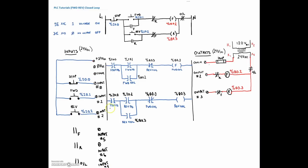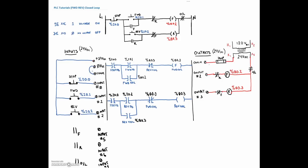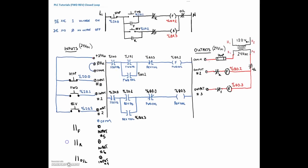Obviously I've got 3 and 4 here, but I'm not showing them in the diagram. I've also got other common connections — my common connections have to be joined together so that I have a path back. On the previous video, I had changed the color to blue for my wiring, but I forgot to jumper my common back to the 0 volts. So if I had a common here that fed each of these, I need to put a jumper from this common over to the negative. That's one of the things that will screw up your program — if you don't provide a path back to the negative of your power source, the signal will be coming into the input terminals but it won't actually see that voltage on the PLC. So make sure you've joined up all your commons.